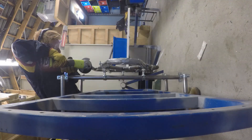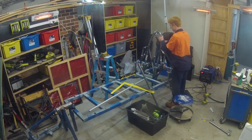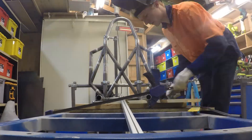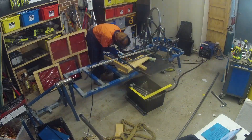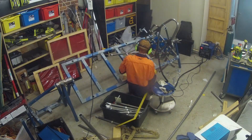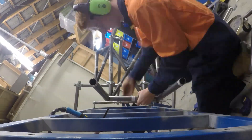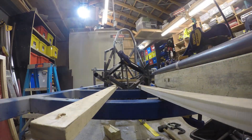The roll hoop had to be positioned at the correct angle — its base was positioned directly onto the chassis jig in a pivoting mount while a temporary brace was attached to the top holding it in position. If I were to do this again, I'd weld the bottom pivoting mounts directly to the chassis jig, as we spent far too much time double checking and repositioning the chassis on the jig as it would move around slightly while being worked on or rotated. The lower members were then welded on, extending the chassis forward. I tried to add bracing wherever long unsupported members were added, to ensure the dimension or position of the member wouldn't change.